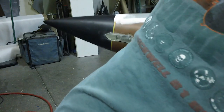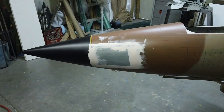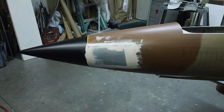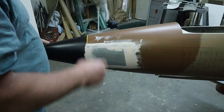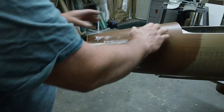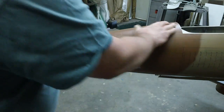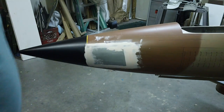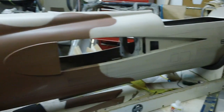You know, guys, if I really wanted to, I could turn this airplane into a B model. Oh yeah, see, as the models got shorter and rounder noses, what I could do is cut this about every 4 inches and telescope them, take this piece and put it inside of this piece, and it would shorten it up. Then I'd have to do a little grinding, a little filling, but it'd have a shorter, more rounder nose, to get rid of that spine.